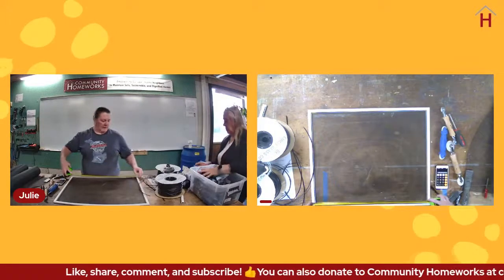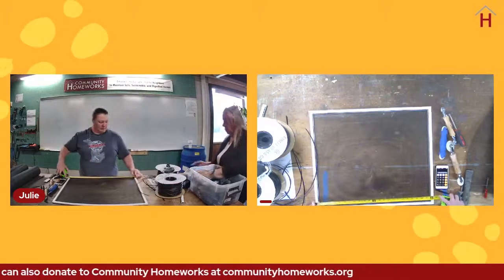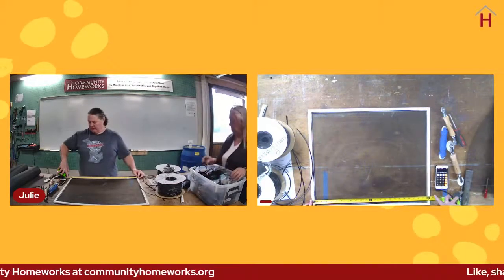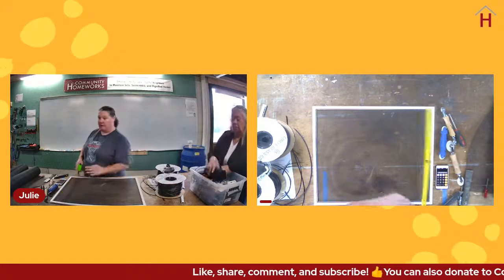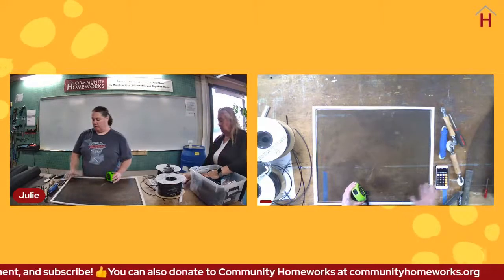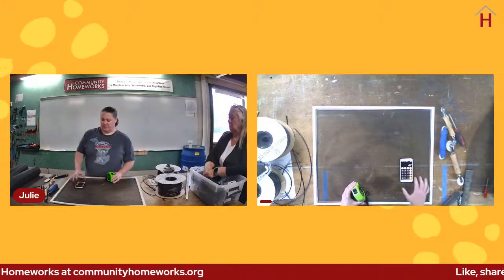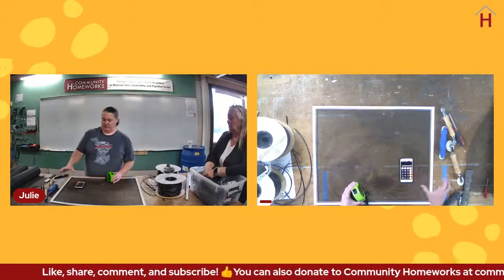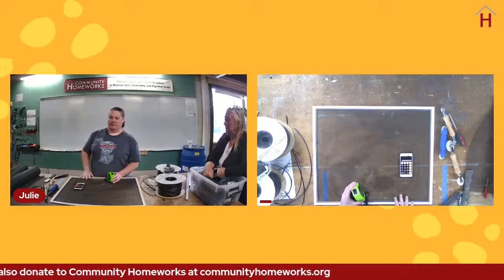If you're happy with that, I'm going to let you turn your brain off at this point. If you feel like I just did something redundant, I will also say that you can measure 25 inches by 22 inches, and the two sides added together is known as united inches. It is a way that screens and windows are measured. If we did it with our united inch measurement, which is 47, instead of timesing by 2 and dividing by 12, which is 2 steps, we can just divide by 6 and we get the exact same number. So instead of adding up all 4 sides and dividing by 12, we just added up 2 sides and divided by 6.